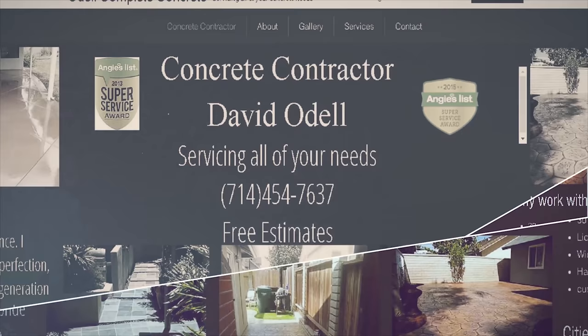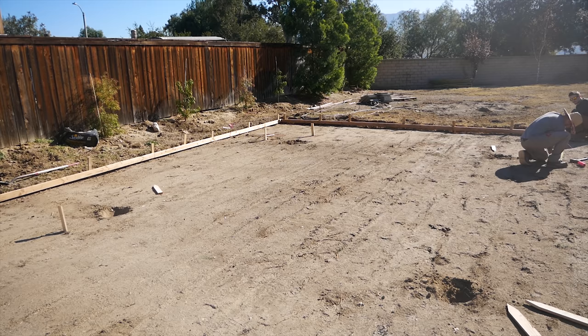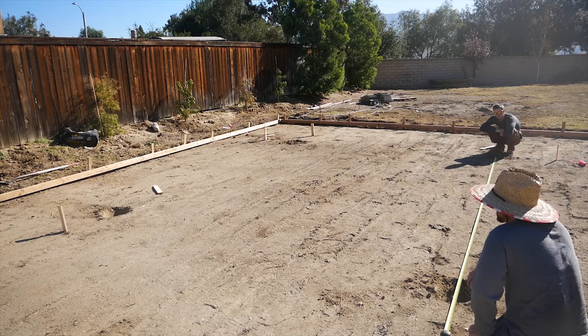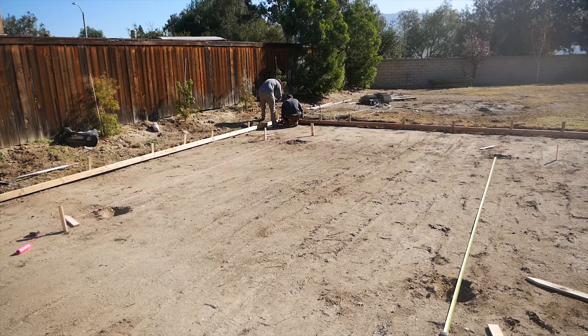This is the final part of a multi-part series. This is my son's job, and you'll see him throughout the video. But this is a really good DIY patio cover. So basically, they just made a square area where the patio cover is going to sit. It's not really square off of the forms because this is a pie-shaped lot, so the structure has to be square. That's the important thing in this particular situation. And they just ran the stakes on past the holes so they wouldn't get in the way of digging.